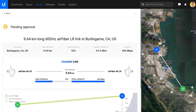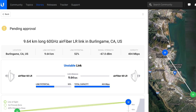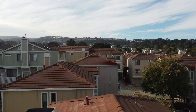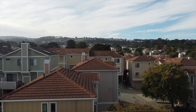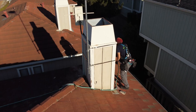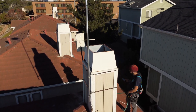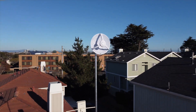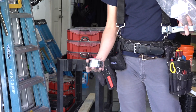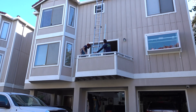What that means is we're going to be putting two radios on two separate locations and transmitting fiber over the air. One of the first things we like to do with these types of installations, we take our drone out to do a visual inspection and make sure there's a line of sight — that's super important before we start putting up poles or anything like that. As you can see here on the floor, we have these inch-and-a-quarter, 10-foot poles that we'll be installing on the roof. We have these roof straps that we're going to be cornering on the chimney and strapping all around on both locations, giving us about eight feet of height to these radios. We're going to get our ladders and get on that roof.